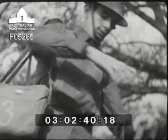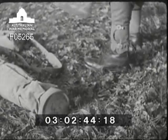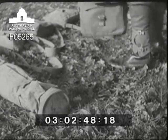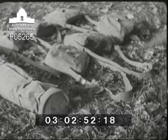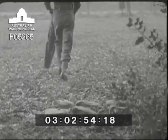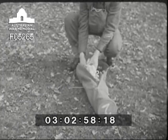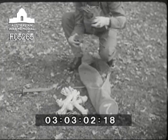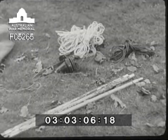He has brought with him the aerial bag and satchels containing feeder, mics and headphones, two drums of remote control cable, battery leads and spare parts. The next job is to take the aerial bag to the site where the mast is to be erected, and there he unpacks the stay plate, spike, counterpoise, insulator and six three-foot sections of mast.